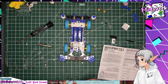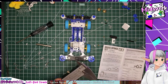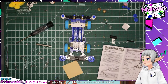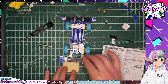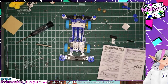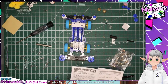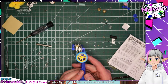This is the 1 millimeter sponge. And it should be thicker than a millimeter, actually. This is 1.15. It's nice and tight. This is a millimeter 1.5. That is wonderful news. That means we can use this to verify clearance. So it's 25 millimeter screw, 20 millimeter screw, 6 millimeter spacer, 1.5 millimeter spacer, spacers that are narrower. So I could add a 1.5 millimeter spacer up here. Should I?